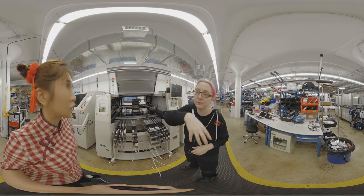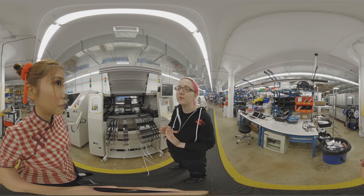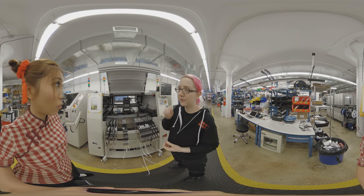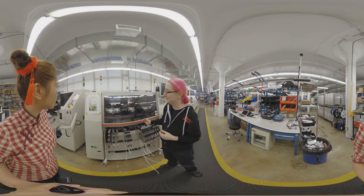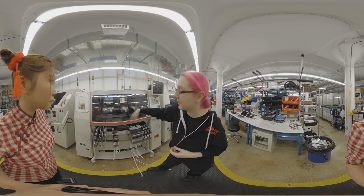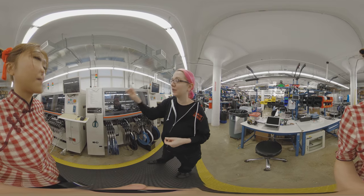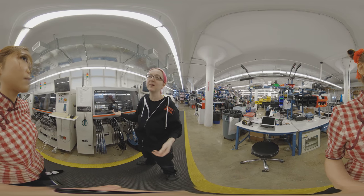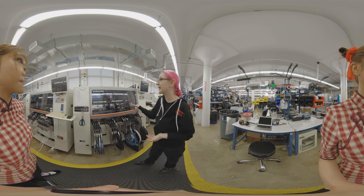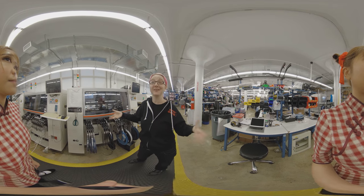Moving XYZ takes a long time, so picking 10 at once really helps throughput. It's specified in components per hour — I think this is 60,000 components per hour. This one is great for picking up a lot of parts very fast and places them at the same time. When we needed to go faster we just got two pick and place machines. This one is by Samsung — they use these machines to make their cell phones. We went to an equipment show and tried all the different machines, and for the price this one was the best. It's also great at placing unusual parts with a really good vision system.